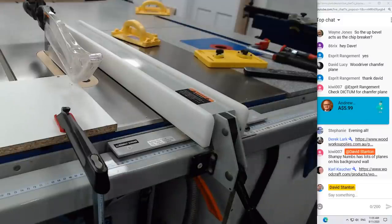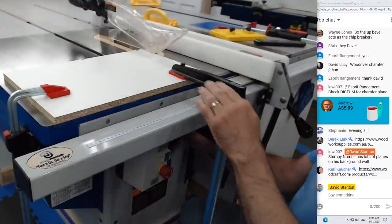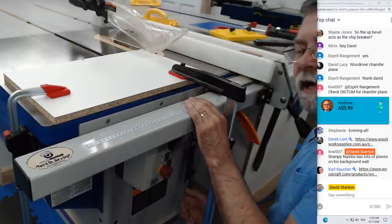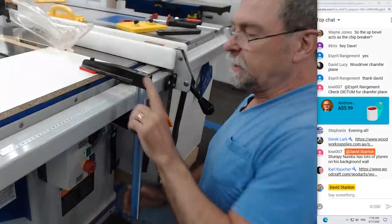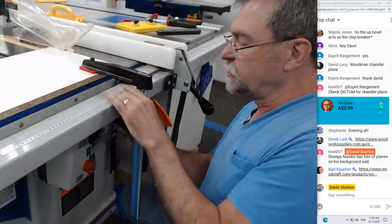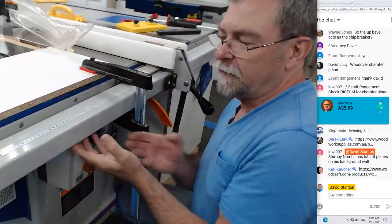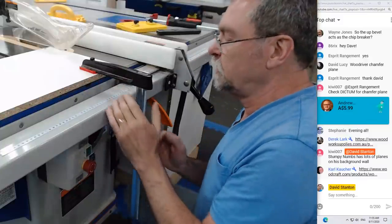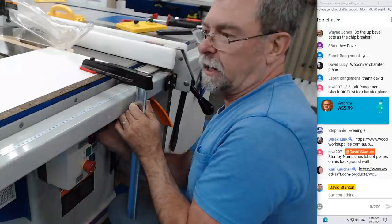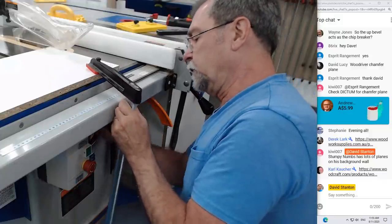All right, I will take these clamps off. Yeah, as I say, be careful if you bring this out over here to clamp onto the rail. You can do that. I'll swing this around just a little bit. You can do that, but put a packer on here and under this so that as you're tightening the pressure up to pull it down tight, it's not going to have any force to try and lift this up and jiggy yourself up further down the track. The deep throat clamps aren't very cheap, I'll tell you that straight away. But when you need them, you need them.